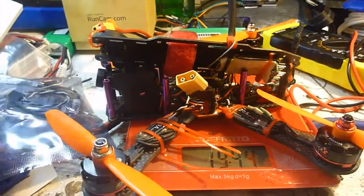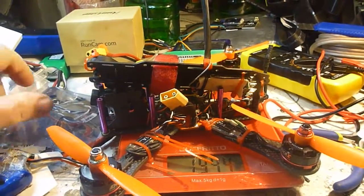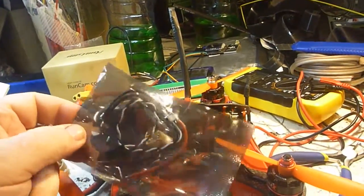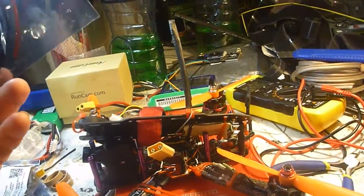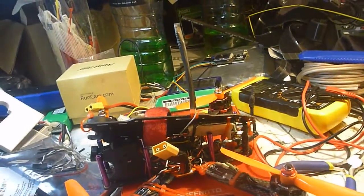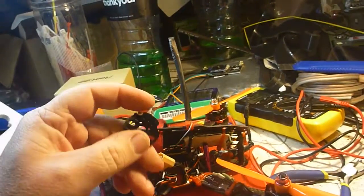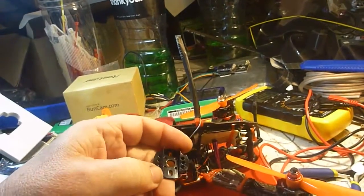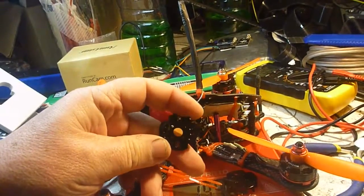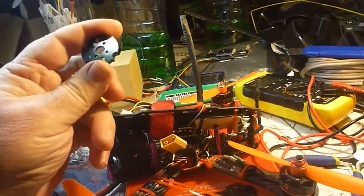I'm going to be flying around with the Little Bees for another couple of days to get a little bit of final tuning in, so I can tune it as good as I can with the Little Bees. Then I'll be jumping on some of these next-generation ESCs, and I'll be able to get a real good comparison between the Little Bees and the Acons. Once that's all settled down, I'll be putting on these angled motor mounts. These ones here are aluminium to help disperse any heat, and they've got a number of holes to mount up to your arms so the motors point in the right direction. Looking forward to doing that — another video.